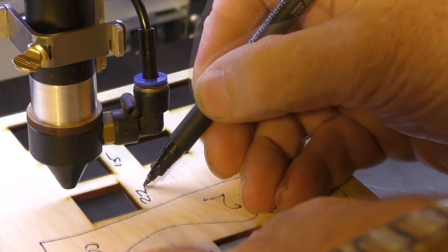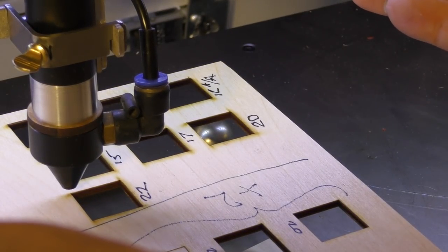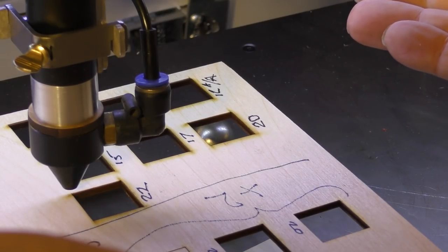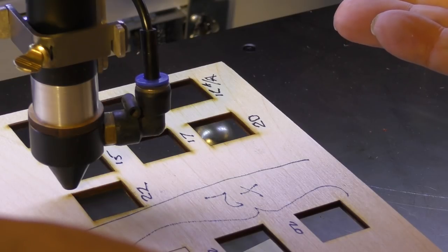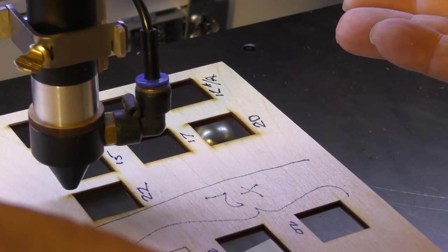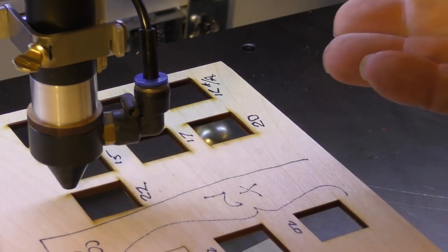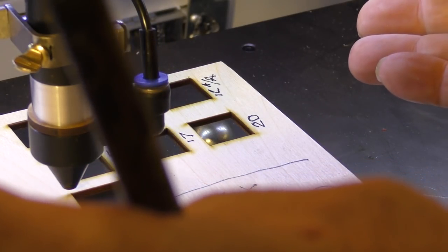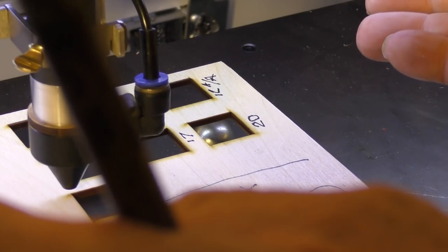Okay. Staggering, isn't it? All I've done is brought the nozzle closer to the work. I haven't changed the focal distance, the speed, or anything. All I've done is increased the efficiency of the airflow through the kerf to blow the smoke away. The smoke is absorbing the energy, and if you don't get it away quickly underneath the job, we haven't got any extra air assist. We've still only got about probably 3 at the most, 4 psi. But what we're doing, we're using it more efficiently.